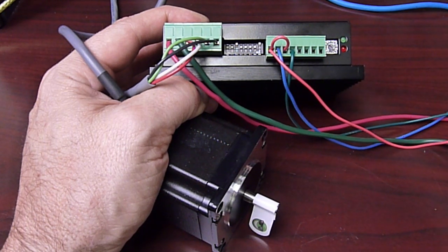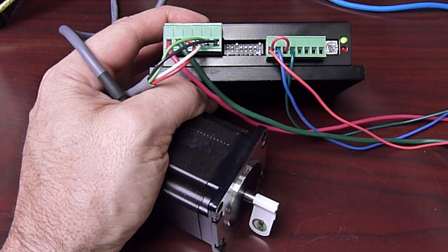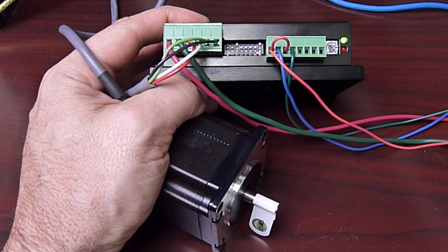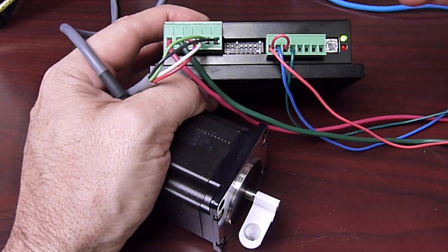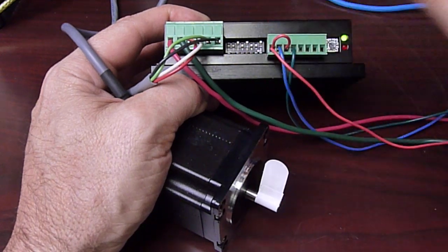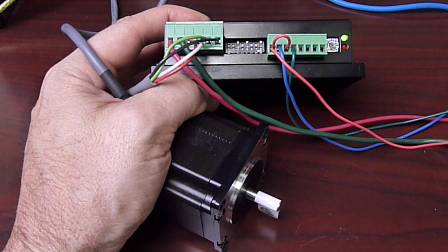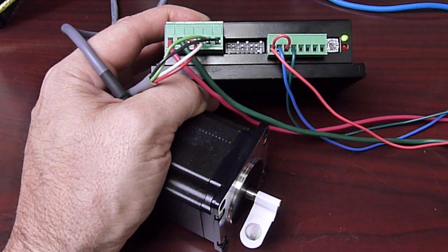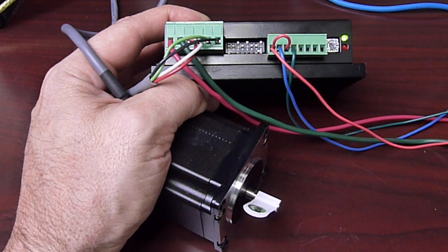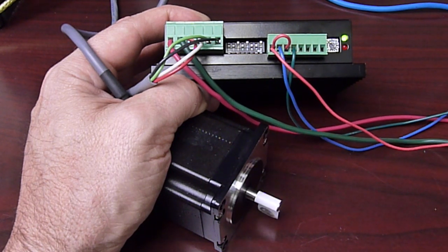This time I'm going to turn it on, then I'm going to reach down to the motor drive and switch DIP switch 5 to OFF. That will put us in smoothing mode and you'll immediately hear the difference. The motor is still turning, but all that coarseness is gone — now it's very smooth. This isn't true microstepping — it's an approximation — but it's pretty close. That's an awesome feature because now you have fast stepping and smooth operation.